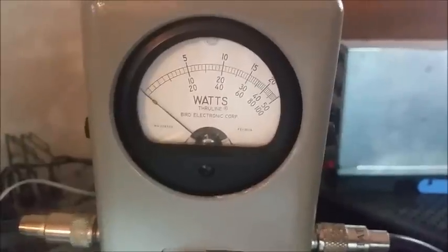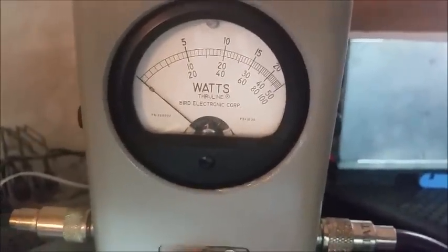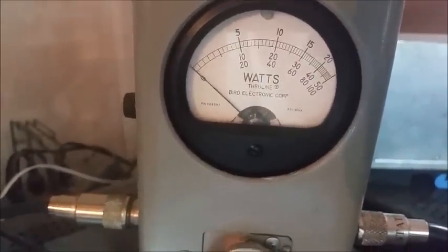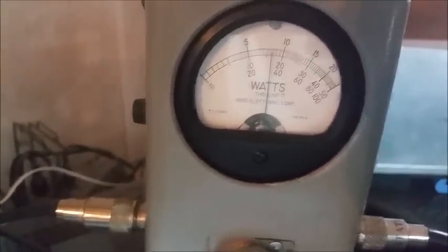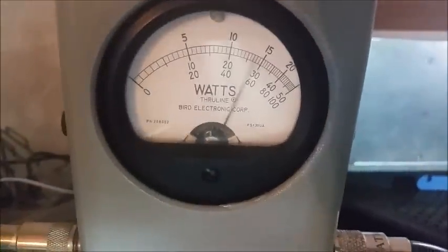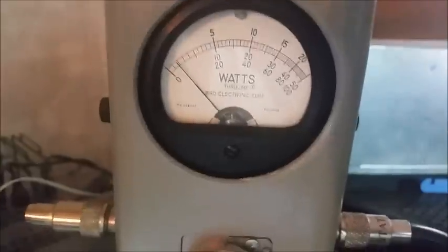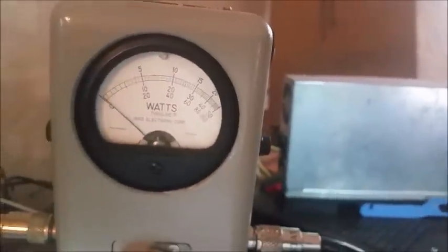Come on now, focus. All right, 1,000-watt slug RMS. Oh, about 320 RMS. Oh, 13.8 volts. I mean, that's amazing for the medium tap. All right, we're on the PEP. Right there about, I'd say, 850 to 900. And on 13.8, man, that's remarkable. That's very nice, very nice.